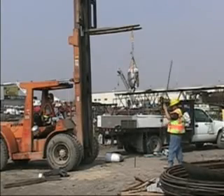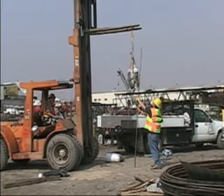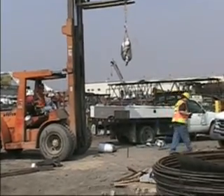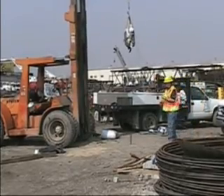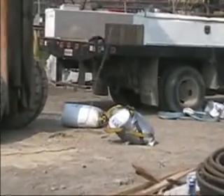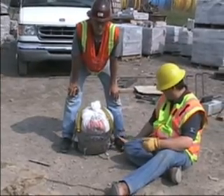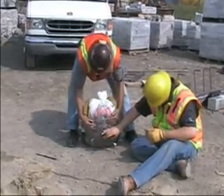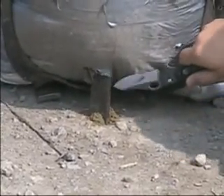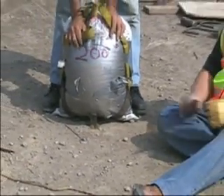In this test, we're using a 198-pound load suspended 7.5 feet above the ground elevation, and we're dropping it on sample number four, which is the form stake. The form stake has an 11-inch vertical protrusion above the ground. It appears that we have an impalement. The form stake — what we think happened is when it fell on it, it went into it. It impaled right here. This is 11 inches long when it came through, so it went right through it. I would think the form stake would be an impalement hazard. It certainly appears to be an impalement based on this test.